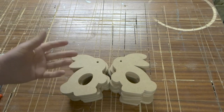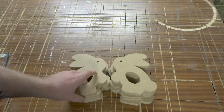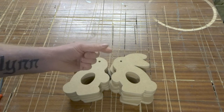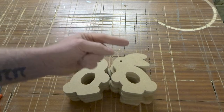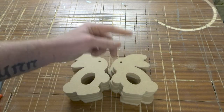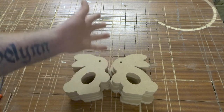All right guys, so I didn't realize that the camera stops recording after 10 minutes — it's a new camera, I didn't really check the record time, so that's my fault. I did get eight of these cut out — it took me roughly half an hour to get sorted. I snapped another blade while cutting the first two, and I realized that the blade clamps underneath my scroll saw had slightly adjusted themselves over time. There's a grub screw that goes from one side to the other and they clamp the blade — the one on the left had backed itself out and was slightly on an angle, so as the blade was moving up and down it was catching on the hole where the blade comes through. That's what was causing the blades to break. I didn't break another blade while cutting the rest of them out, so it's perfectly fine.